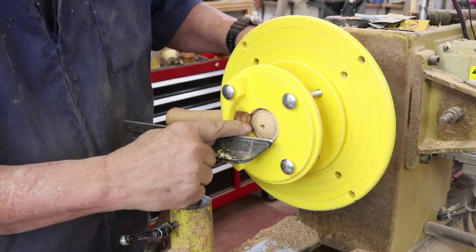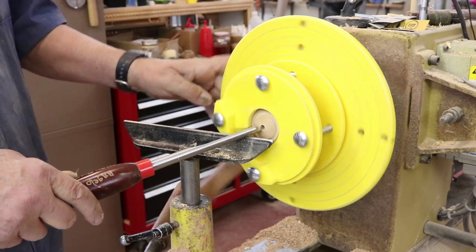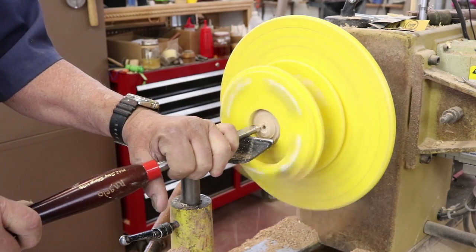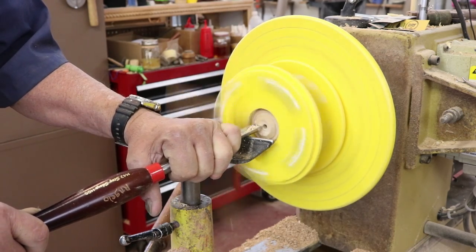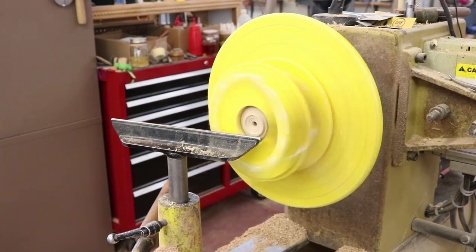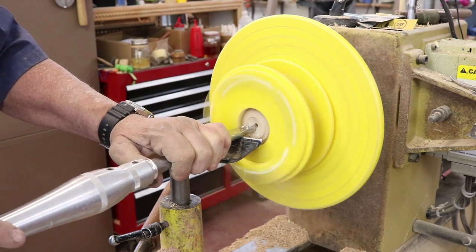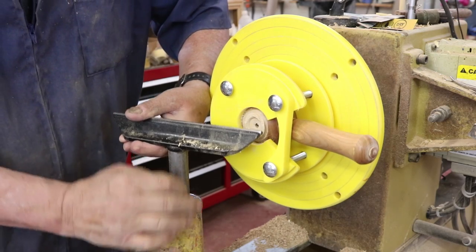I just took a little parting tool to define where that rim is going to be. I'm going to start out with a gouge and try to hog out some of that wood. Now, no matter how you chuck a ladle up or a similar device — with that spinning propeller — it's difficult to judge the depth. I probably took 10 or 15 minutes of footage and reduced it down to a minute or a minute and a half, and I go through a number of tools.